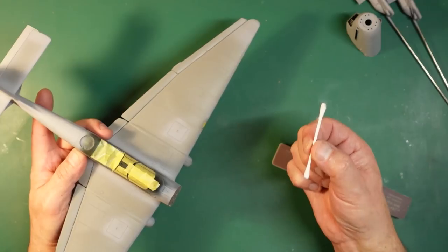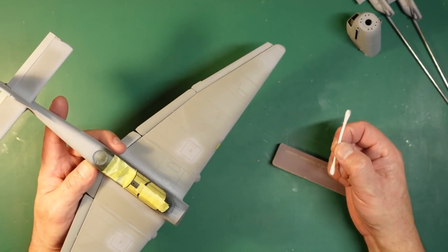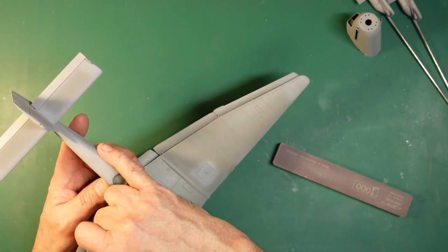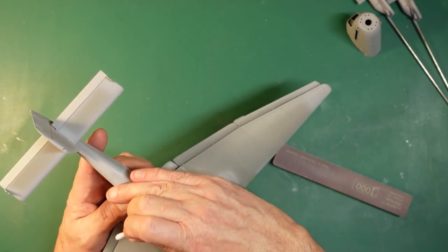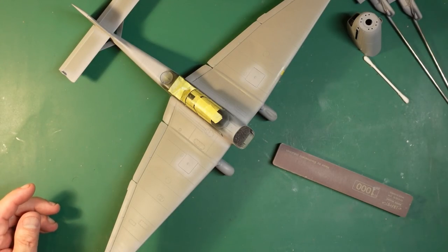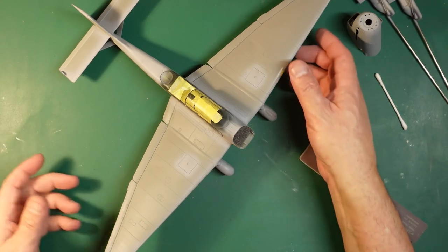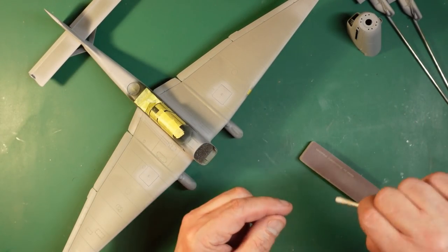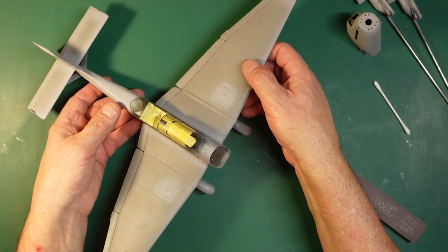I just made the fatal mistake of picking up a cotton bud that was on the bench - as I keep telling you time and time again, you should never do it, and I've just done it. This is something I used to clean some grease off. I've just wiped grease onto there. I should be able to go over that with some IPA and rub it away. Honestly - I tell you not to buy anything other than Johnson's cotton buds, I go and buy cheap Aldi cotton buds. I tell you never to pick a cotton bud up off the bench without knowing what you used it on, and then I go and do exactly that - I'd just been lubricating bearings on a radio-controlled car.